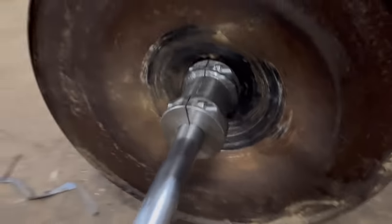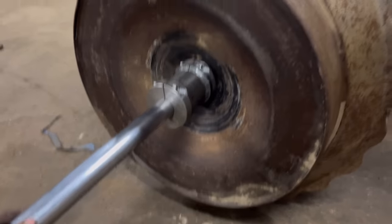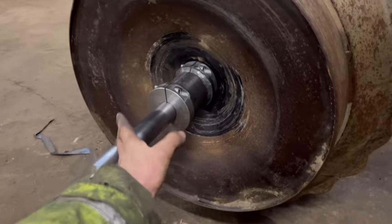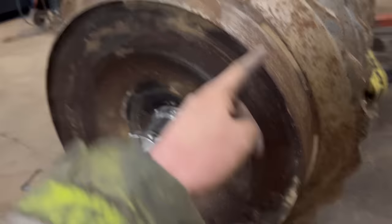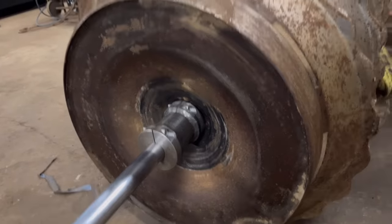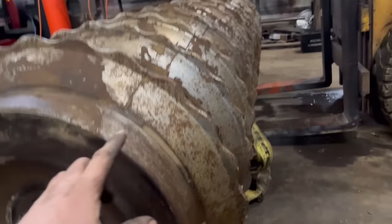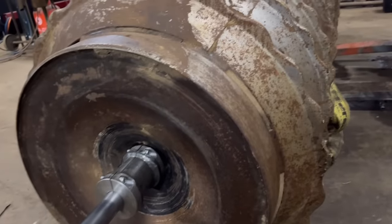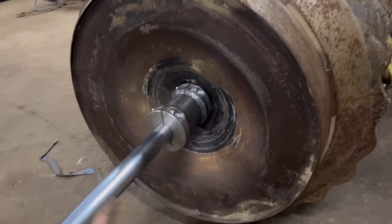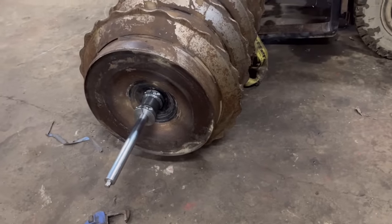So that fits on there exactly like I intended it to. It's nipped up onto there, nipped up onto there, that's all solid. What I'm going to do when I put my bearings on is stick my dial gauge to it, see if I can run the dial gauge around the outside of there, just to make sure we are something like true. These don't always wear even, I've noticed on other ones I've done, other packers. They don't seem to wear even all the way around, so that might be a problem, but as long as we get somewhere near the middle, it should be right. They're not made that accurate anyway, I don't think, so yeah, pleased with that.